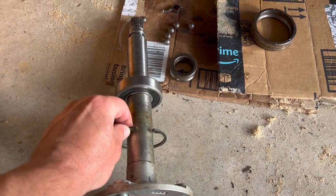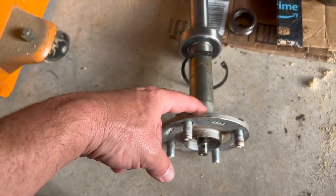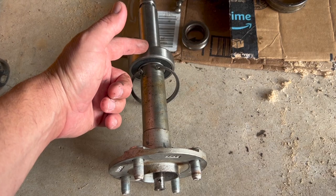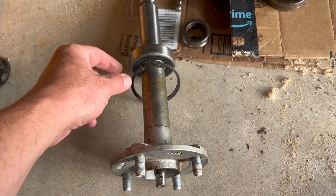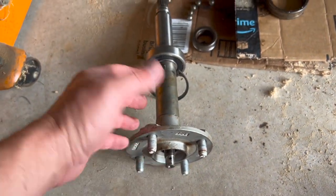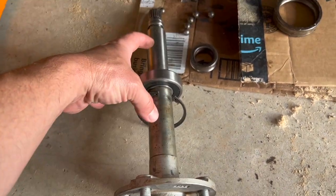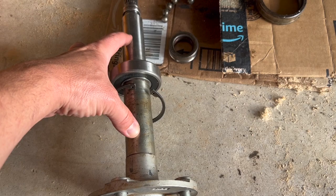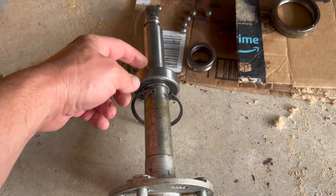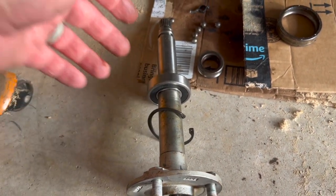I went ahead and got the split ring back on here so that I can work with it — that needs to go on before this piece does. It's really hard to get it on over the shafts. The best process is to press the new bearing on, put the new sleeve on, put the split ring on, and then slide this back on — and all of that should be able to be done by hand. There's a chance you'll need a press to put the new bearing on. You could try putting the shaft in the freezer overnight to make it a little bit smaller, which should allow you to slide the bearing on easier. Or if you have a local mechanic, go ask them — they may be willing to do it for you.